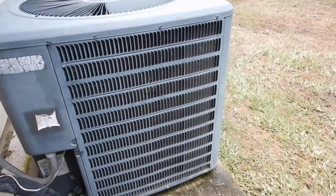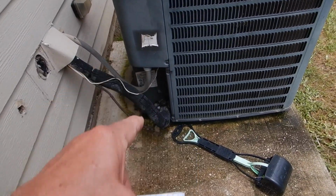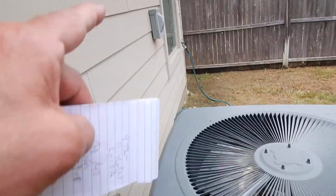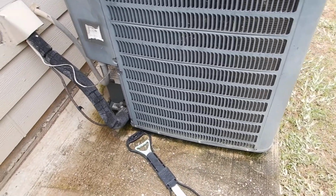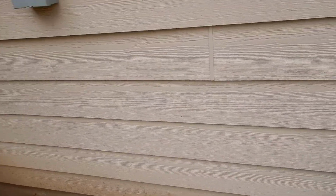We learned that our coils are dirty. We have the wrong kind of insulation. We do not have the proper caps. The condensing unit is dirty and the disconnect should be sealed. Those are the things that we learned. That's not too much. Those are all the usual sins. These walls should all be addressed as well.